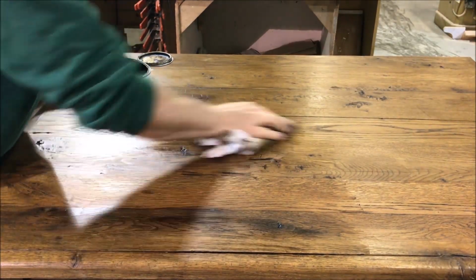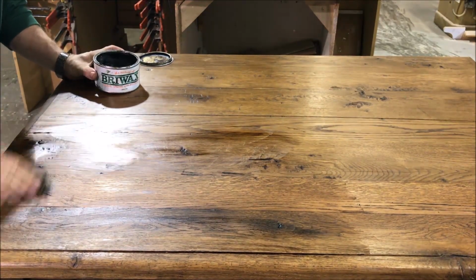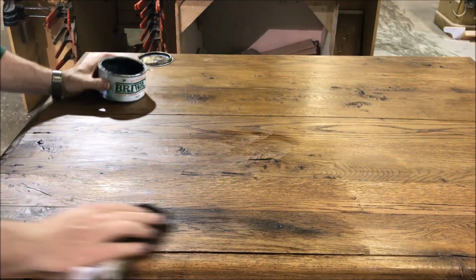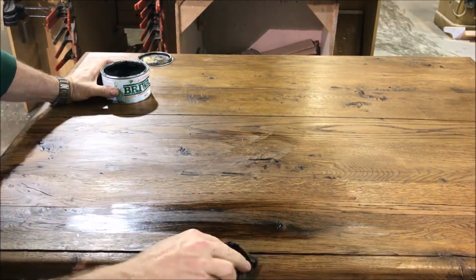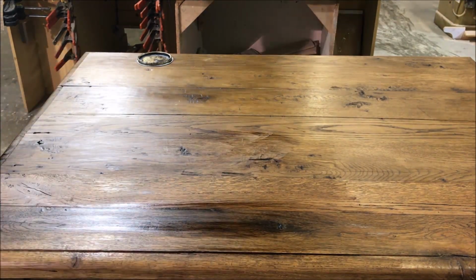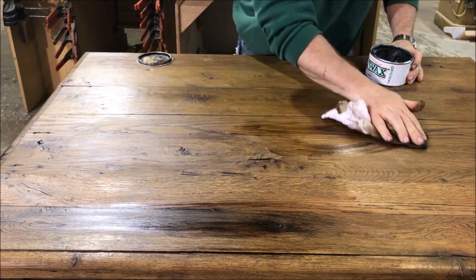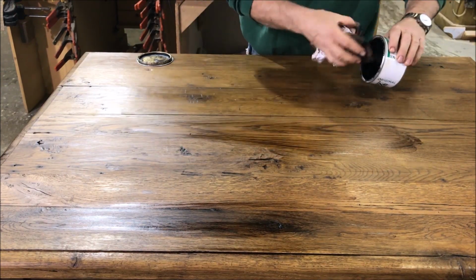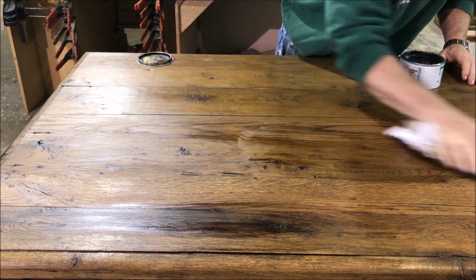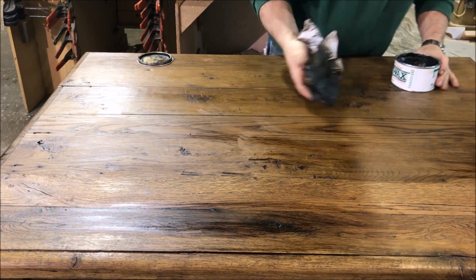And with this wax the solvent will dry out, it'll harden, and you'll be able to buff it and get a shine out of it, but it's going to be a problem because it's a hard wearing surface, unlike the trunks or the cupboards that we just looked at, or picture frames or beams that are rarely handled. You know, if you wax some beams up on your roof, nobody's ever going to touch it after you're done waxing it, so it's not an issue.